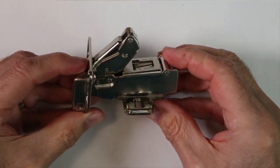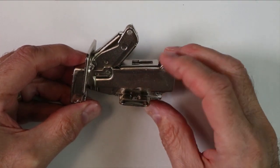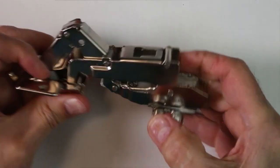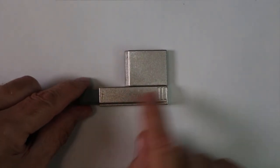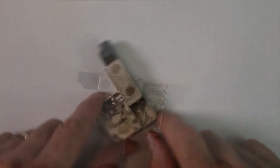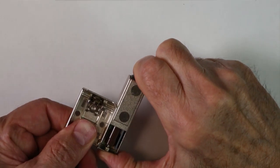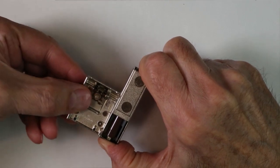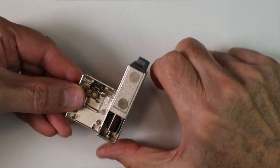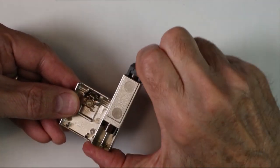Without a damper, the spring will slam the door against the frame. So we fit a soft-close mechanism to the hinge. Here's the soft-close mechanism — it's a little hydraulic cylinder inside. If I push against this grey piston rod it takes a lot of effort. You can see the piston rod come out when released, and it slowly releases its energy.